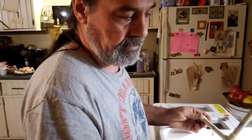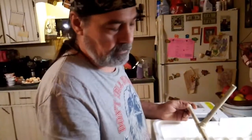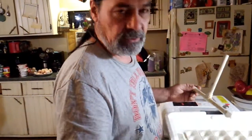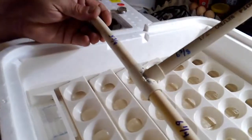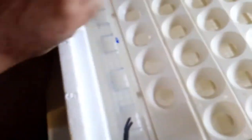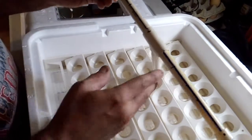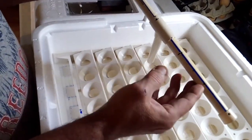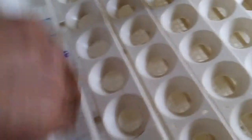For example, this is a half-inch CPVC, so naturally the pipe goes half an inch inside the fitting, but you have to calculate for the rest of it also, otherwise it's going to be too big or too little, too tall or too small. Our measurements were six and five-eighths inches on our up stem, five and three-quarters to the left, and six and a quarter to the right. Down in here we've cut out sections in our screen where our reservoirs are, and in the bottom we drilled little 1/16th inch holes exactly where they fall in each one of these reservoirs.